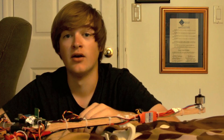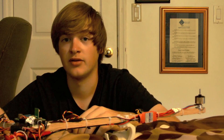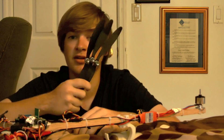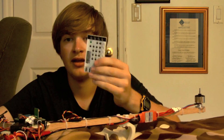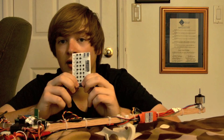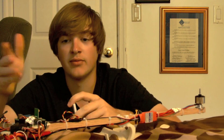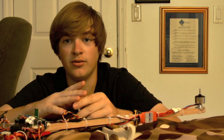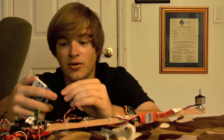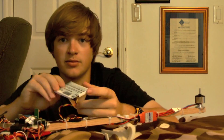The next step is to program our ESCs. This is really important so that you don't crash when your battery becomes low on power. The first step is to take off all the propellers so you don't accidentally get cut, and then you need to get your ESC programmer. I have a full parts list in the description with this included, so if you want to build this tricopter go check that out.